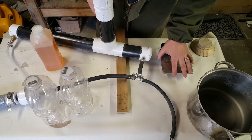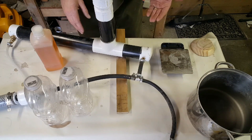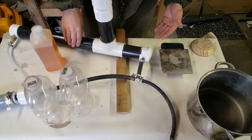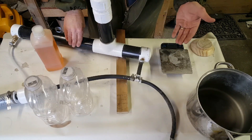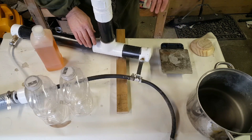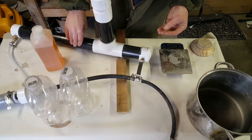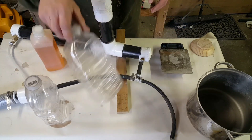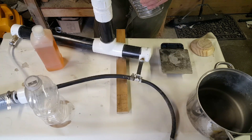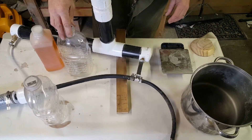For Portland cement, if you're using a 94-pound bag, you're going to want to mix six gallons of water with it. Six gallons of water is 768 ounces, and when you divide that by 94, it equates to just 8.1 ounces per pound of Portland cement.